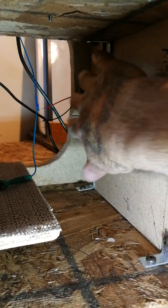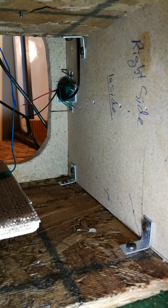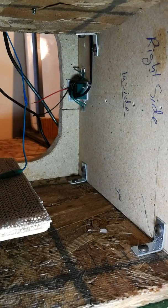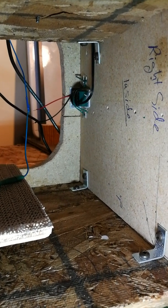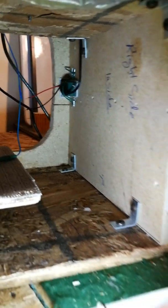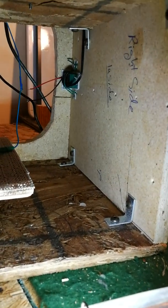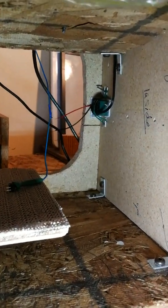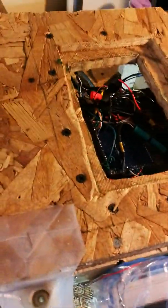What you have here is a switch — it's actually a double pole double throw. The ground and VCC are both disconnected in normal operation. When something goes wrong, I pull out the probe, connect the clips from the probe, poke and prod and figure out what the voltage is where. I just press the button in the back, connect the red and black clips to the probe. That came in handy quite a bit. That's most of the electronics.